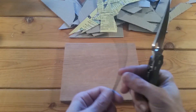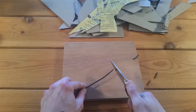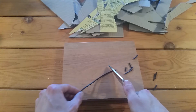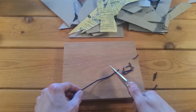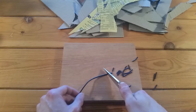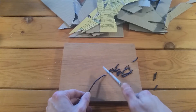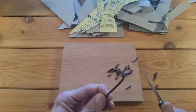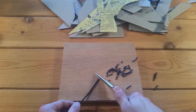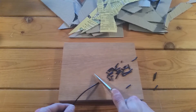Maybe I'll show you how it push cuts through this speaker wire. I like to do this because it tests the very edge of the knife and basically tests the leanness of the grind. If this knife wasn't heat treated right and it had a very lean grind, it would chip out just from this minor use because the heat treat wouldn't be right on. So when I'm doing these push cuts with this copper wire, I'm focusing on one portion of the blade just to see if I could force that to happen. If the heat treat on this is right, it's not going to happen no matter how long I do this.